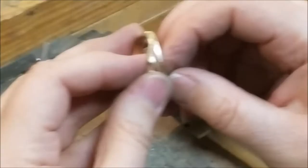Then do that on the other side too. But let's work on these grooves. I'm going to go right down the center of these grooves with a saw blade, just to clean up and make a nice crisp line at the very bottom — that way you can see if there's a pit hiding down there. This is a very thick area so you can go pretty far with it. This one's curvy but I'll give it a try — the saw blade's a little bit flexible. I'm going to start at the top half of the groove and just feather down.